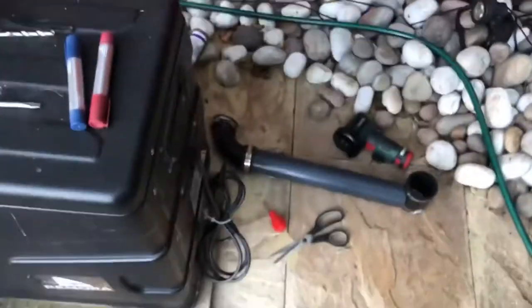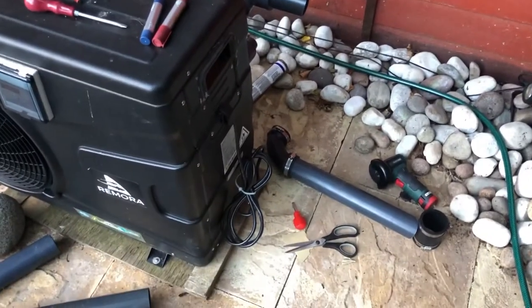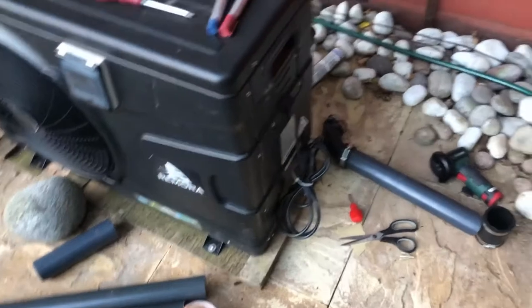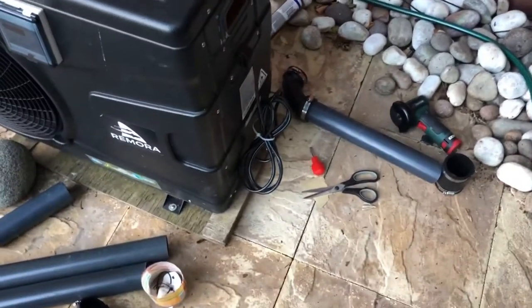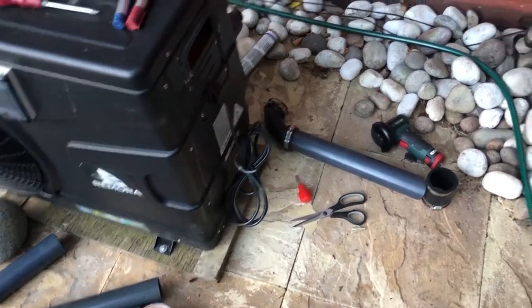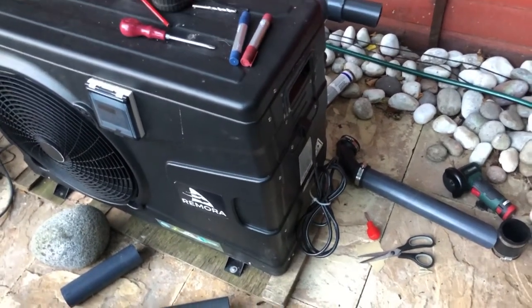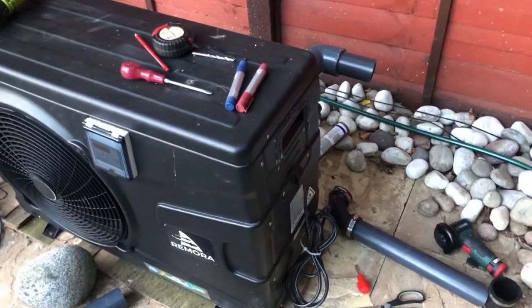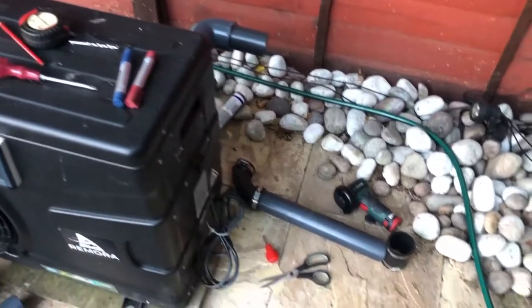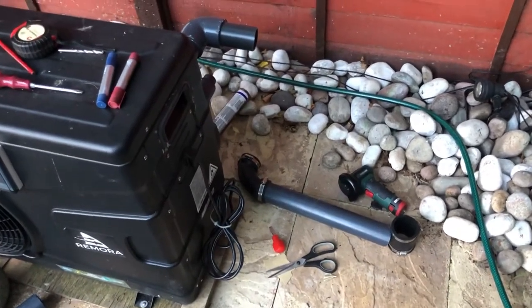The Tempest slides right in. Moving on — plumbed out all up for two-inch pipe on the outlet, just getting all the measurements correct. I'm using flexi easy connectors, the rubber boots, just because it's easier. I can't be bothered to solvent weld at the moment, and it's easier to get everything off if future plans change. Cordless angle grinder to cut all the pipes — let me get all these measurements and start cutting. Daylight is starting to go.